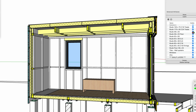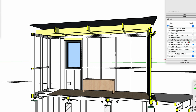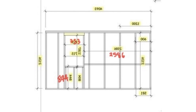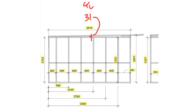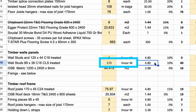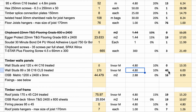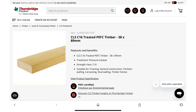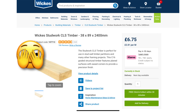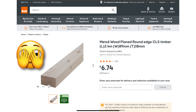Once I know my panel lengths based on room sizes and ceiling height, I can draw each panel in elevation — imagining it lying on the floor, since that's how I'll be setting it out. I measure the total timber length and divide by 4.8 meters, which is the cheapest standard length, delivered on pallets by my local timber merchant. Avoid the temptation to buy shorter lengths of 2.4 or 3.6 meters from a DIY store — it's way more expensive and involves more cutting and waste.